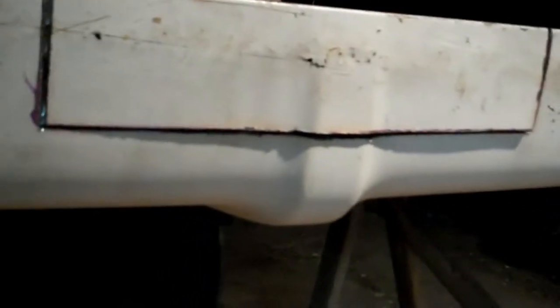So I've made the cuts here on my old hood. I got the rusty part at least cut, and I did drill out the spot welds. I just want to make a few points here. There is inner structure behind this skin, and all you want to get off is the skin. So don't cut too deep, especially here, which is the bottom of the hood, the lip, or here on the front. There's some structure back there.